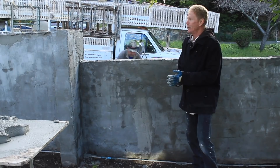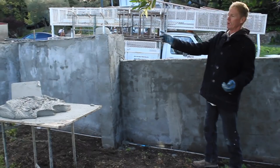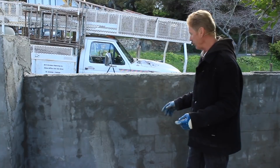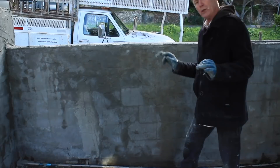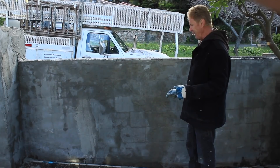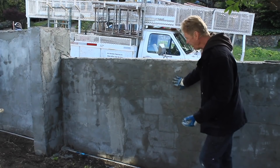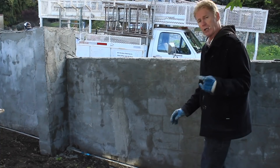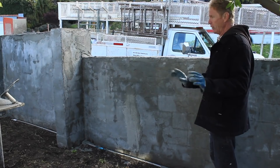Kirk Jay here with Kirk Giordano Plastering. Today we've got what we call fun happening — we are going to skim coat all these block walls. The guy here took five years to build this. What he's got is CMU blocks, concrete blocks. Cinder blocks are not as strong as concrete blocks. When you wet blocks, you can see the outline unless you go at least a half inch thick, so when it rains you'll see the block lines. We're gonna skim this — he already had a fella skim it but it didn't turn out so pretty, so we're going to put another skim coat on, this time a little thicker so when it rains it won't show.